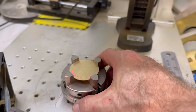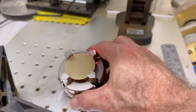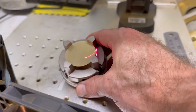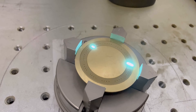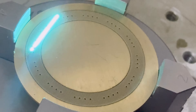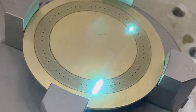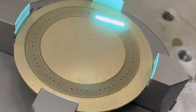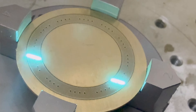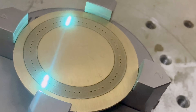We're going to get the brass blank aligned where it needs to be using the laser marks the system puts down, then get it started and get this brass blank engraved. When you get a galvo fiber laser, you're going to calibrate it and make sure that one millimeter is one millimeter on the output. I've already done that on this, so I know my galvo laser is calibrated — if it's showing 33 millimeters in LightBurn, it's going to be 33 millimeters on the output. That's something you set up when you first set up your fiber laser.